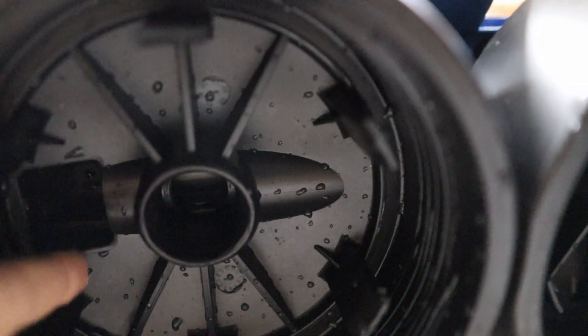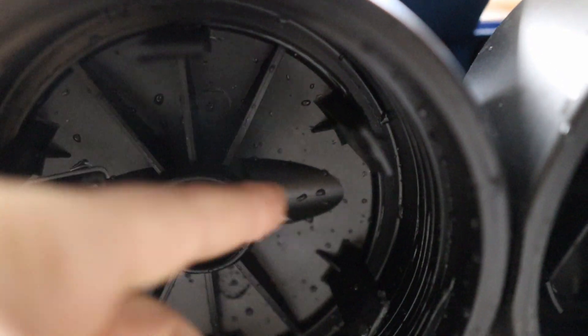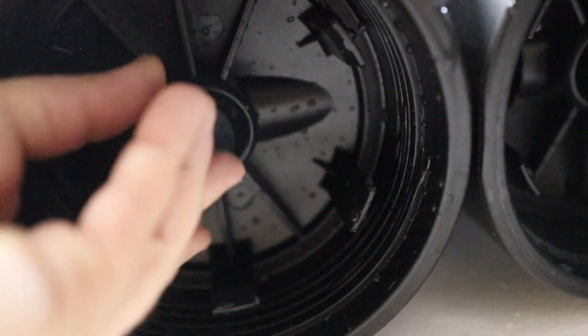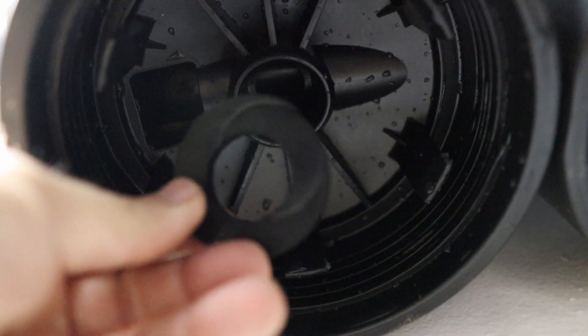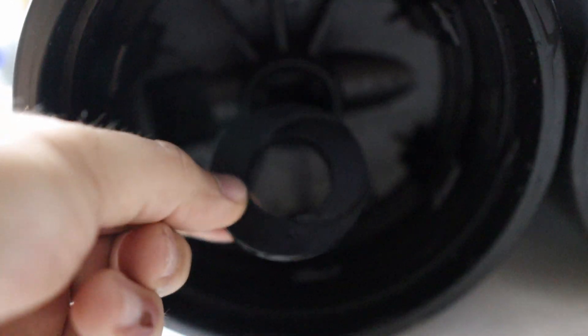As you can see, we have this hole. Water comes in here, goes down through the filter, comes up through this hole, and then out and into the next filter. On this mod, these tubes actually go into the center section. The old way the filter would sit and this would seat them together. You can even see where my seal was not exactly where it was supposed to be — it was not lined up correctly. I could have had blow-by from this first filter.